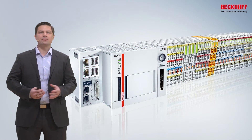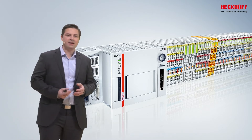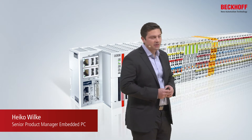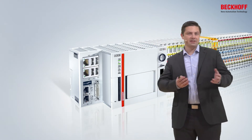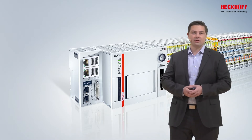The first embedded PCs at Beckhoff were released in 2001. Embedded PCs at Beckhoff are PC-based devices which are directly mounted on the DIN rail and where you can directly attach I/O terminals — may it be a KBUS terminal, KL, or an EtherCAT-based terminal, so-called EL terminals.